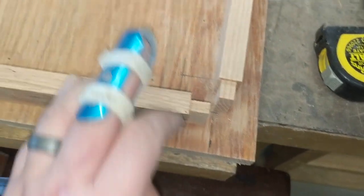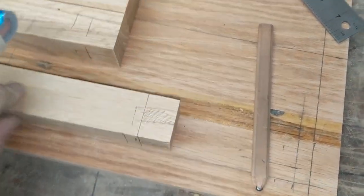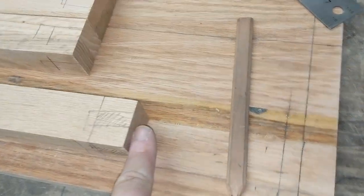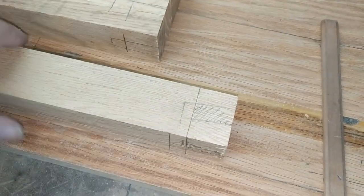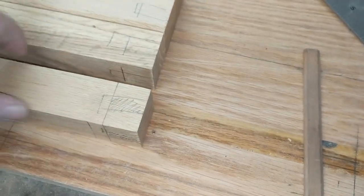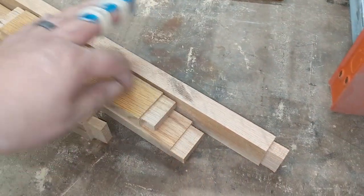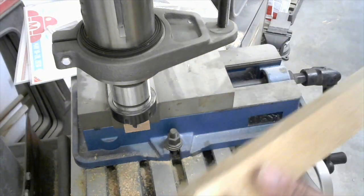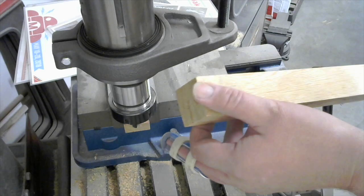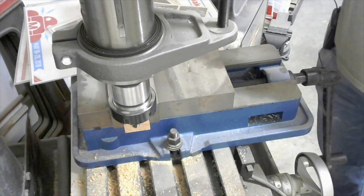Time for almost the last step. I need to put some mortises in the legs, so I'm going to use a half-inch router bit, go down about half an inch, go in with the router to the line and stop. Do that for two on each one and hopefully they will just slot straight in. Then I'll run a rabbet along the inside edge and use the original clips to screw it down to the base, and then decide if I'm going to put the shelf in or not. I've done a test mortise — normally you'd do this with the router but because I've got a nail, I'm just using that. I clamped the wood in and marked it to exactly an inch.